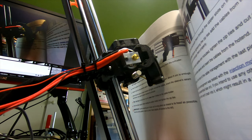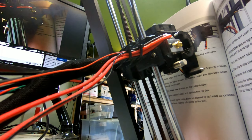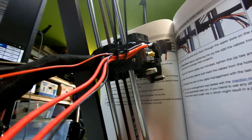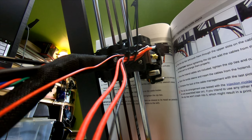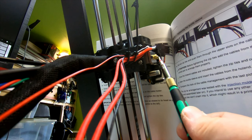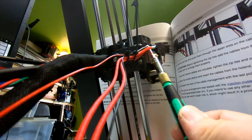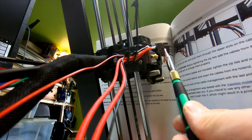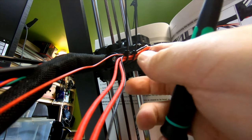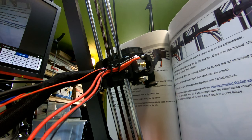And the thing is that you should also make sure, I have the book here to block the light from the window, because otherwise it's blinding the cam, to make sure you actually have the horizontal clearance between the top of the extruder here, or the bottom of the extruder, so that these will not foul your print or anything and get in the way. So make sure they're tucked up and held in place. So anyway, that was research I thought I'd do.